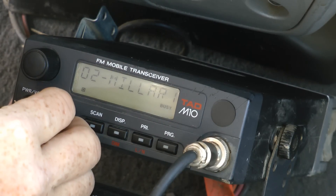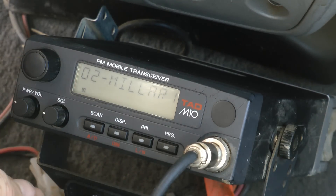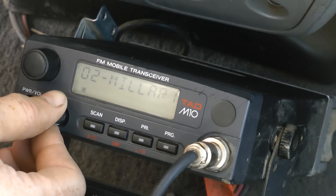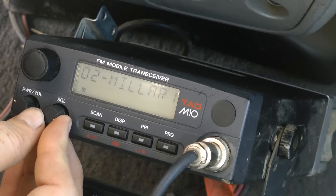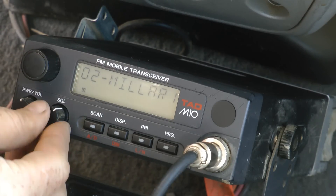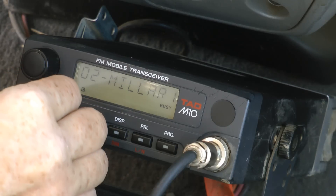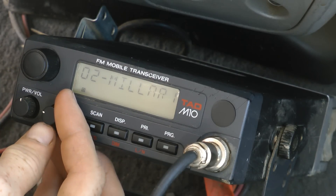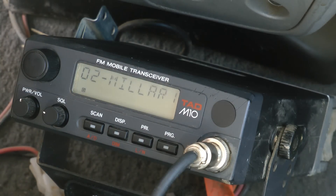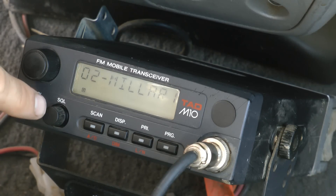Right now there's no conversation. If I've got somebody a couple of miles away from me, I'll probably hear them no matter where this dial is set. But if I've got someone about 20 or 30 kilometers away, if the radio is set way over to the high-squelch side, I'm not going to hear them. The best way to set this is to turn your squelch knob all the way counter-clockwise until it makes the noise, and then just a tiny bit back to the right. By doing that, you don't have that annoying background noise all the time, but you do have the most sensitivity — the least amount of squelching.